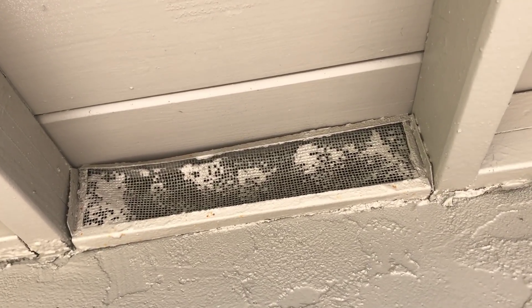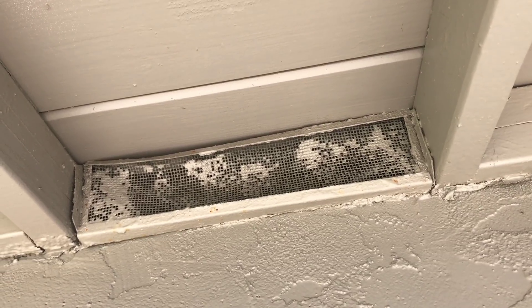This is an eave vent that you don't want — you'd want to replace this. I've just filmed that video from the attic and you can see how hot it is. Having this fan is just such a helpful thing to get positive airflow cruising through the house. It's cheaper than air conditioning and very effective. Just open the door or window on the cool side of the house and it'll suck that cool air in and push it up and out. I need to get out of this attic — I'm dying!